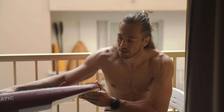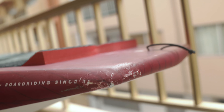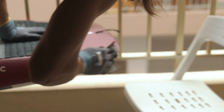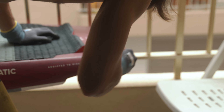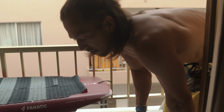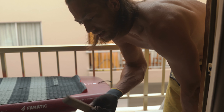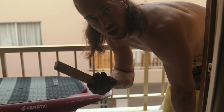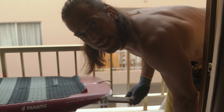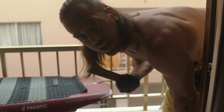As you can see right here there are quite a few cracks, and I'm not sure how far they go, so the first job is to sand down and reveal the actual extent of the damage. If you have flat surfaces to sand down, instead of just using your hand and sandpaper, I recommend getting some sort of a flat strong object like this piece of wood, and then using that to help you sand down - you can apply more pressure and get the job done faster.